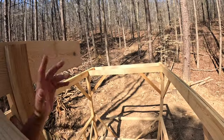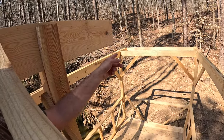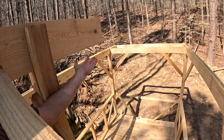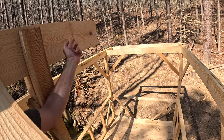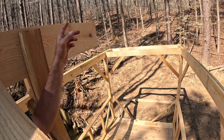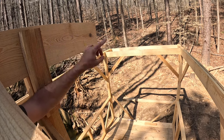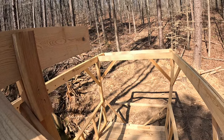All right, so now we're ready for our next piece of ridge board. We've got to get another beam pocket like this, put that over there, set that up, cut our ridge board to length. I'm going to nail a block to the underside of this ridge board, toenail the two ridge boards together, and then the beam pocket, and then put these rafters here on this splice, and then a second set down there, and man, we are going to be done today.